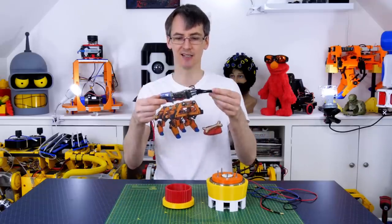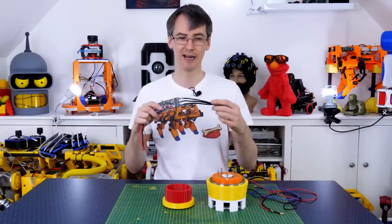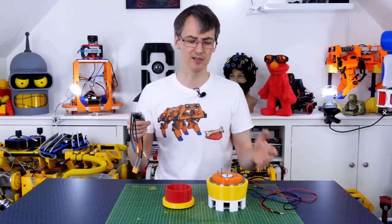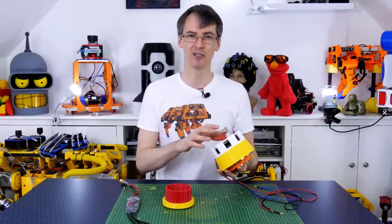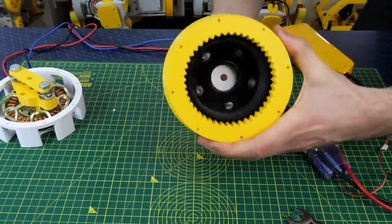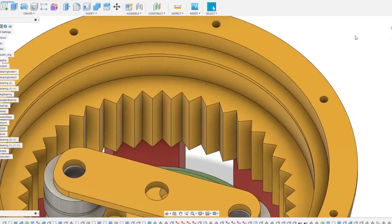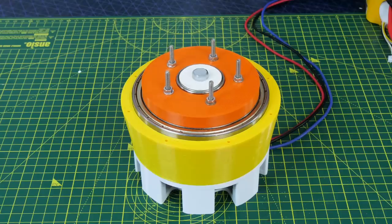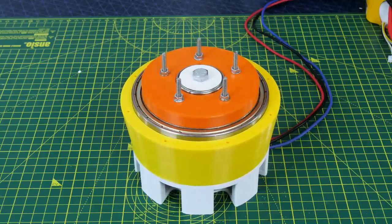The VESC is meant for skateboards — it's not the most ideal thing for this. There are no sensors on this motor either, so it has no idea where the motor is, and in order to energize the coils of the brushless motor in the right order it just uses the back EMF coming off the coil, so it's not a very good solution really. For torque tests in the future I'm going to do some proper tests probably with an ODrive and an encoder on the back of the motor so we can energize it properly and compare this with the cycloidal drive. I thought that where the flex spline isn't flexing near the top where it's attached to the rigid part it might be catching on the outer teeth, so I brought that part down so that teeth are only where the bearings actually push the flex spline into the teeth. I also removed one bearing on each side so that it only flexes the flex spline right at the bottom — that seems to run a lot freer and it's much happier starting up the motor at low power.